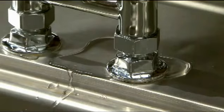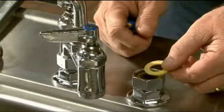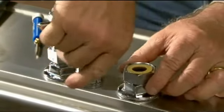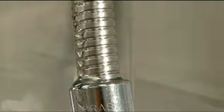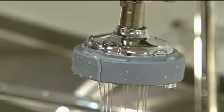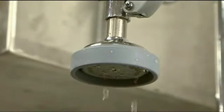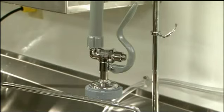Leaks at the coupling flange are due to an old gasket, and replacing that will solve your problem. On a pre-rinse unit, leaks may be even more obvious. A leaking hose is one that is punctured or perforated and needs to be replaced. A leak around the spray face means you need a new rubber bumper. A leak through the spray face itself means it's time to replace the bonnet assembly.